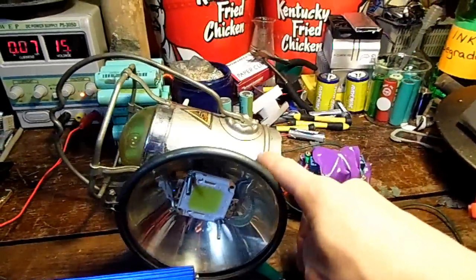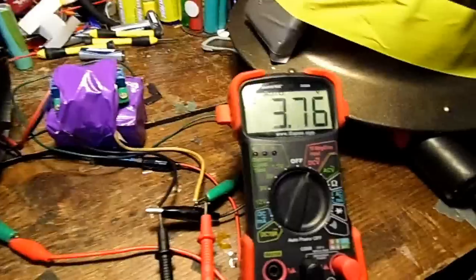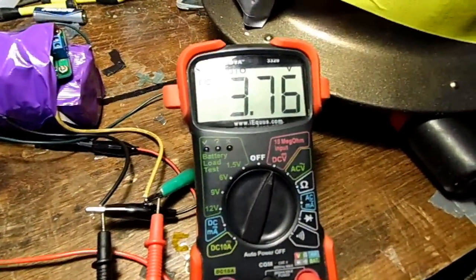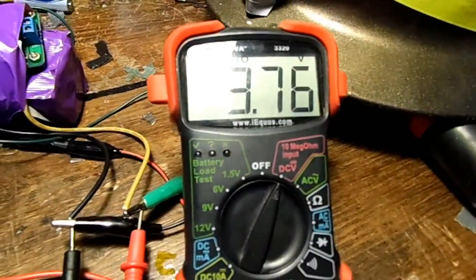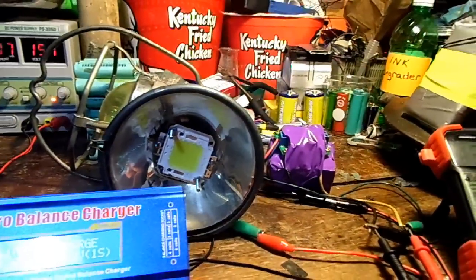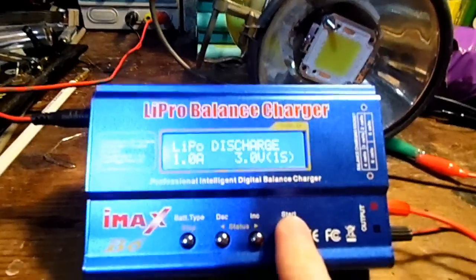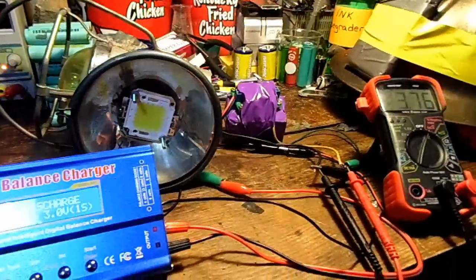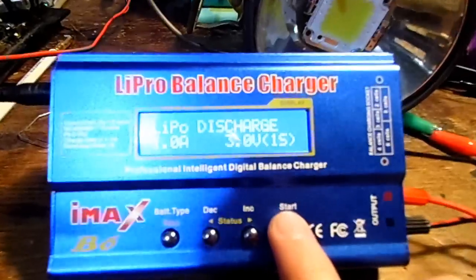That's for sure. Oh boy, this light I built definitely does sap those lithium batteries. Just from a month or so, or actually, just a couple weeks, it's already down to pretty much empty, to where now, whenever I pull power from it, the voltage goes down to 3.4 volts, and it starts to flicker really bad. So let's do a discharge test and get the capacity all the way down, and then as we charge it, we'll see how much capacity we have from zero.